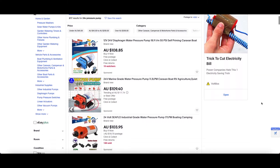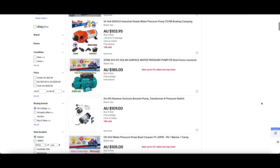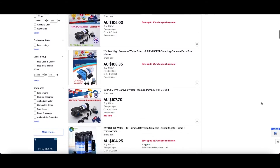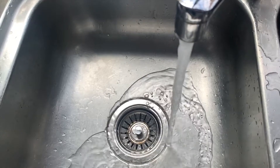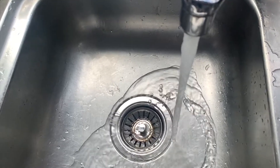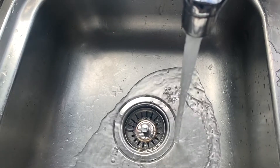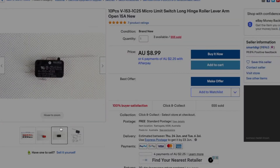I definitely have plans of upgrading this to a 24 volt model; alternatively I'll build a better 12 volt DC converter. So far in the review we've got a sturdy pump with excellent pressure. For the most part it runs off 27 volts without any major problems. There are negatives though — I've gone through about six or seven micro switches.